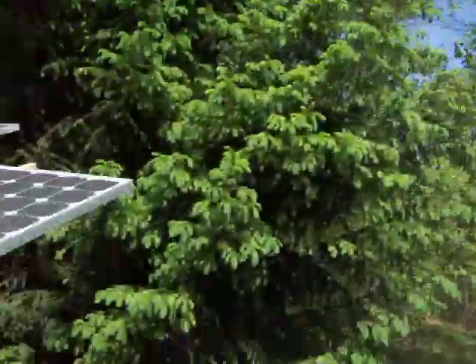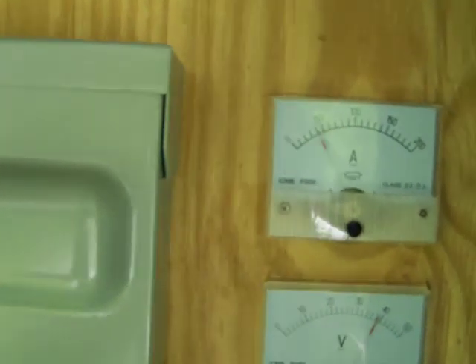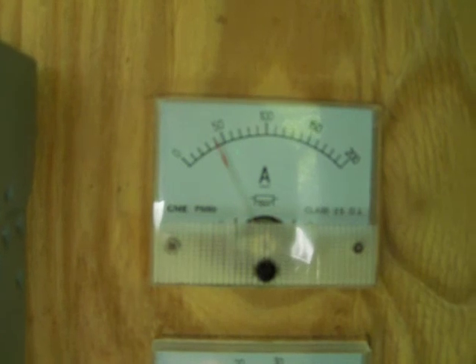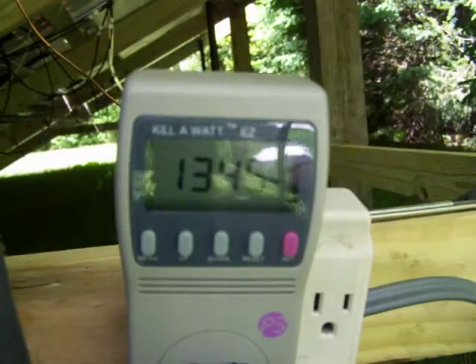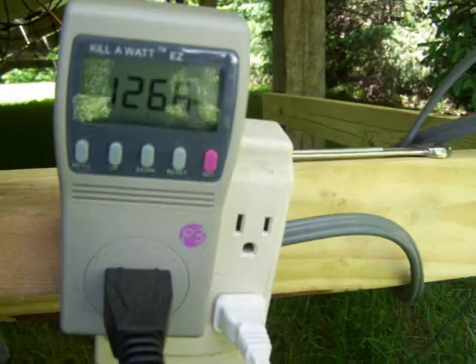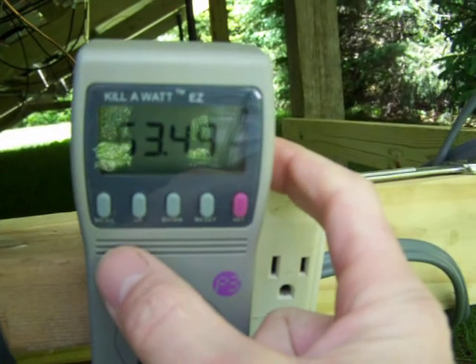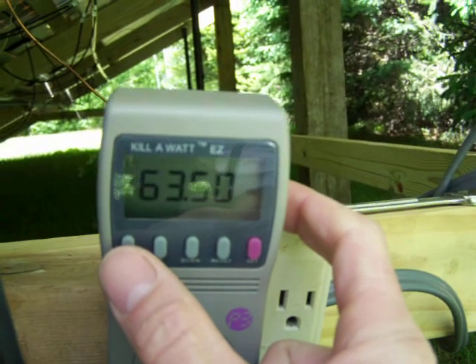Let me give you a little DC reading out here at the array. This is DC now — we've got about 40 amps DC, about 30 amps. I do have another meter out here. Someday I'll figure out what the difference is from this meter to the one in the house and be able to figure out what I have for line loss. This meter's made 63 and a half kilowatts — I think the other one in the house said 61, but I'll have to check the video.